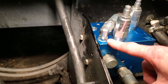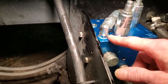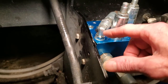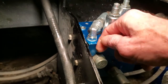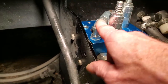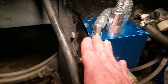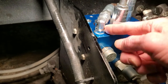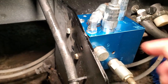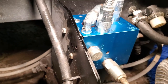I did call Zamboni about it and it was a good move because I would have tried to unthread this whole thing and tried to thread it back on. But Don explained to me that this is a little elbow that threads into the manifold right here, and this is just a nut that screws down to seal down this threaded fitting. This hose has to be pointed a certain way, or at least the fitting does inside how the manifold is set up, so you can't really have it any other way. I used the 11/16 wrench as well as the adjustable wrench just to tighten it down. I don't think I even got a quarter turn — it just kind of snugged down really good. Hasn't leaked for 3 or 4 days, so it's really good.